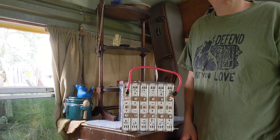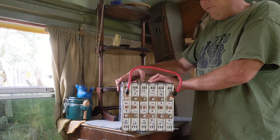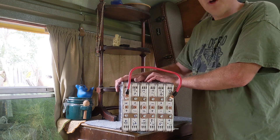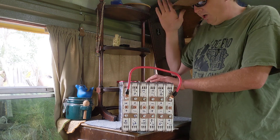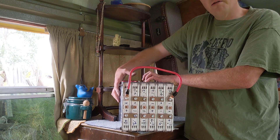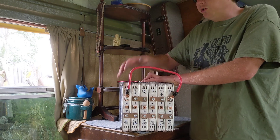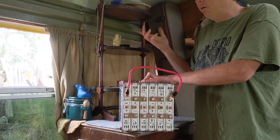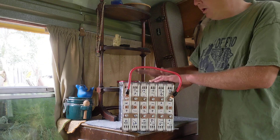That's the beauty of the LEAF modules. You might lose a little bit of capacity from their original factory specs, but even at that capacity loss it's so much cheaper that you could just buy another three, or another seven if you want to do a 48-volt system. You can't use them in 12-volt systems, but the price difference is so incredibly massive. If you get three and they're at 70% capacity — lost a full 30% because they're used — you'll still be able to buy three more packs to make up for it before you even get to the price range of one Battleborn or Windy Nation.